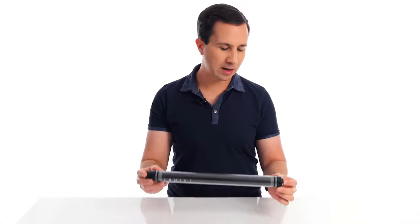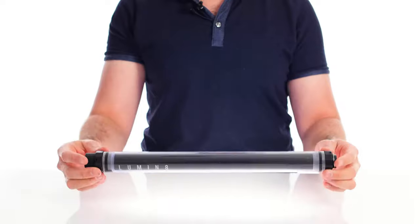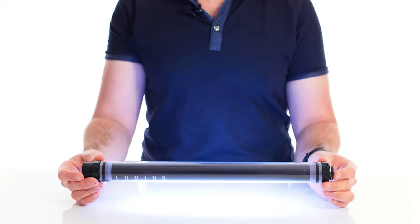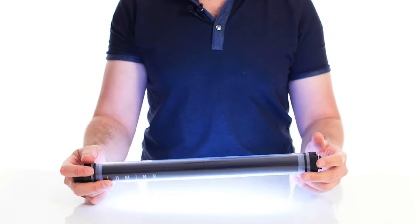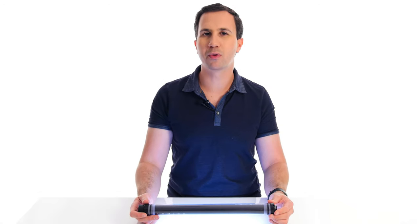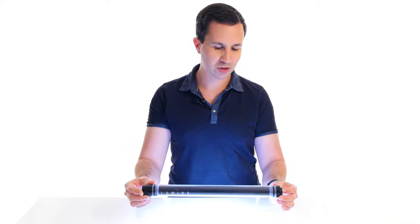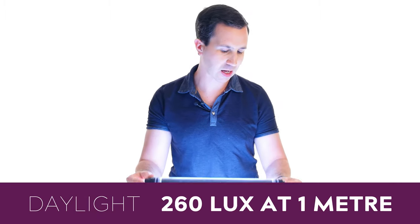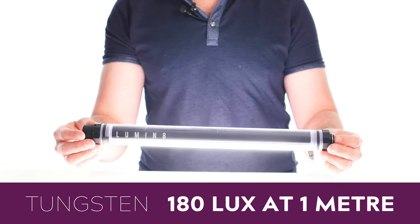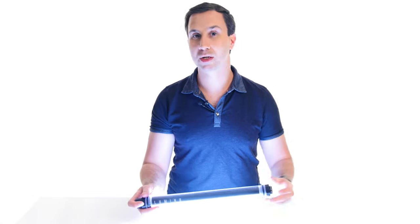It's also a bi-colour light — you have your tungsten setting at 3000 Kelvin, and if you double-tap the button on the end you cycle over to your daylight setting at 5500 Kelvin. Both have a fairly comparable amount of output, with the daylight being slightly brighter. I measured it at up to 260 lux at one meter on daylight and 180 lux at one meter on tungsten, so a little bit more output from the daylight setting, which is what we were using most of the time.